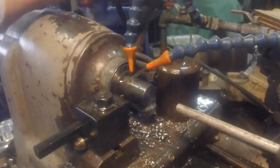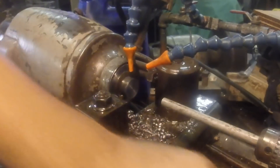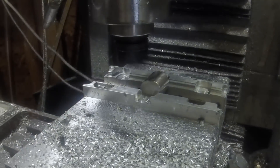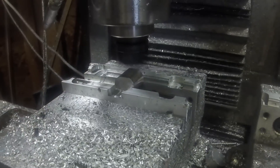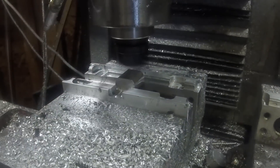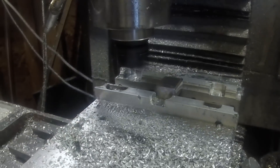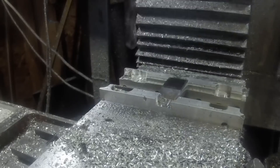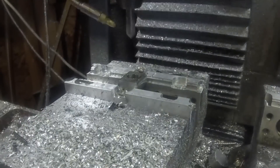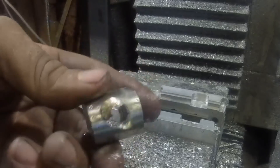So it's back to the turret lathe again for what I'm going to call the pivot. This is just a piece of round stainless — all I'm doing is parting it off and deburring those edges. Now I've got it in the mill and I'm going to put a flat on the top using the superfly. You'll see what that's for once it's assembled. The superfly cut through that stainless but I don't think it liked it very much. That's it for this part aside from a burr around the bottom side of the hole — it's done as well.